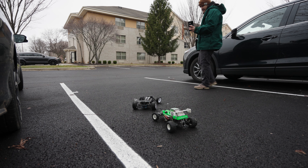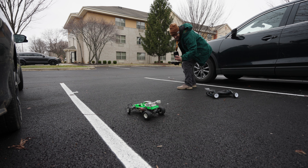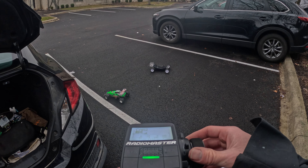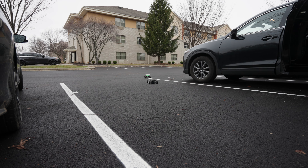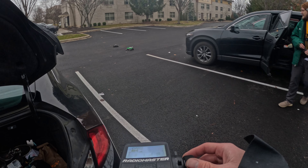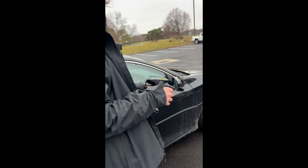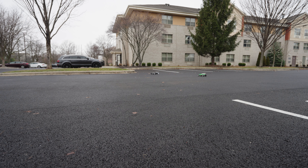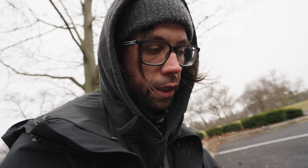What's really awesome about ELRS is that it's open source. One thing that's pretty interesting about ELRS is that you can flash a passphrase to the receiver, and also that exact same passphrase to your transmitter. So every receiver that you own can have the same passphrase, and all you have to do is flash that passphrase and it automatically binds.